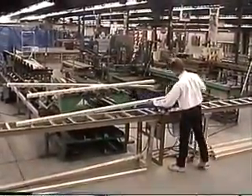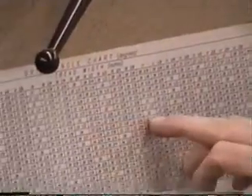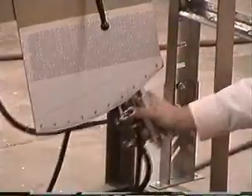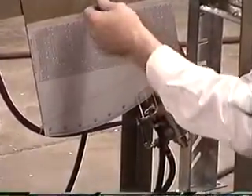I'm going to go through the angle setting. How do you set the angle? Let's pick a real common dimension. The scales down here determine what degree we need to be at. The chart indicates your riser height on the left-hand side and your tread width in inches on the top. These are fairly common scales — a lot of guys have cheat sheets in their pockets. For this drill we're going to say 7-11, so I go to 7, come clear over to 11, and it tells me 32 and a half degrees. All I have to do is break this loose — it slides back and forth quite easily. I've got a plexiglass pointer scale with an arrow on it and a scale at the bottom, and that gives me the correct degree I need.